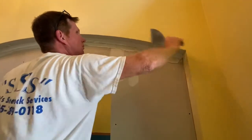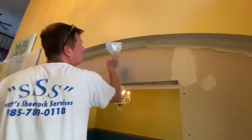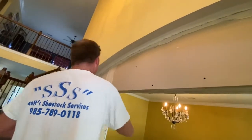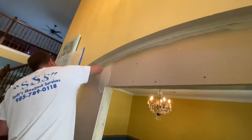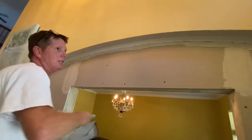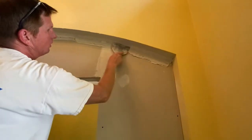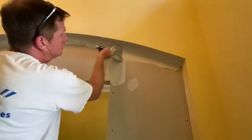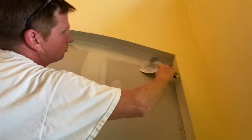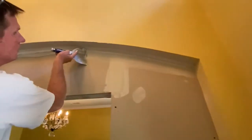Got a bit of bumps going on here, right under there. Wipe that top side nice and even. As you see, you've got your teeth here. I like to put a little bit of mud across the top of it real even before I wipe it. Then same thing — just kind of stick that real gently. It's not a lot of pressure, just real gently lay that down like so.